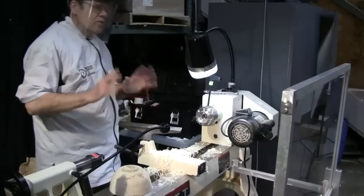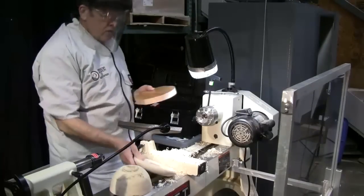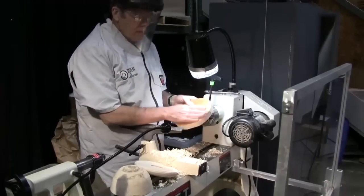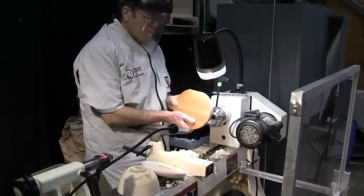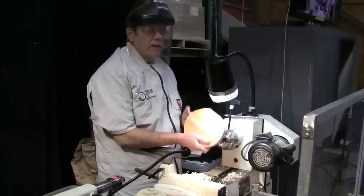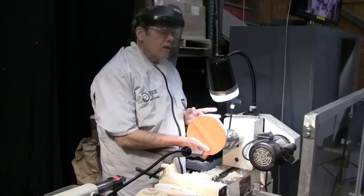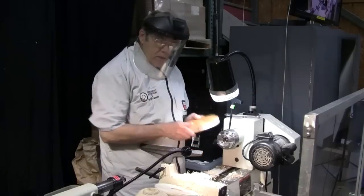The next thing we're going to do is work on the top. There's a couple of possibilities. You can use some kind of kiln-dried wood. You can glue it up even if you like. For the top, sometimes kiln-dried wood is a lot easier, and it's certainly easier to get in a reasonable size. 3/4 is probably a little thin, but if you got 5/4, it'll trim out about an inch. That'll make you a good top.